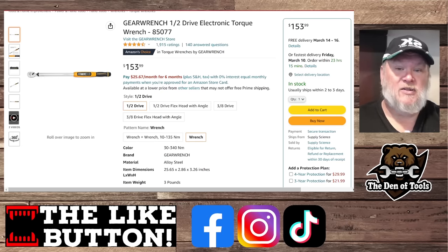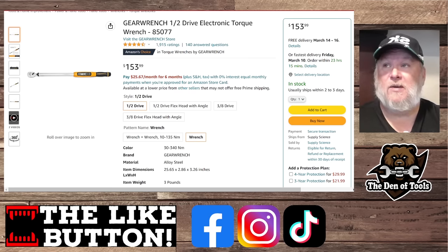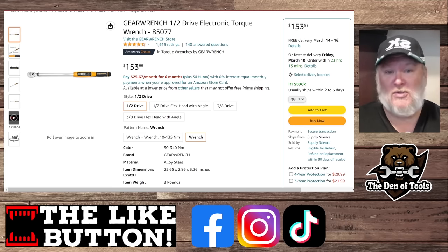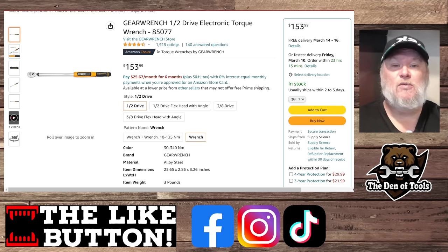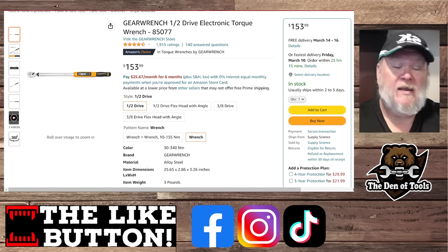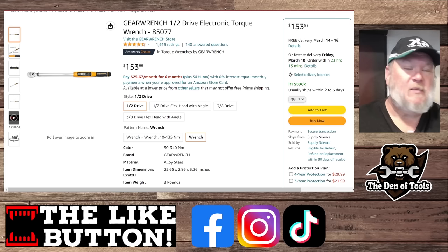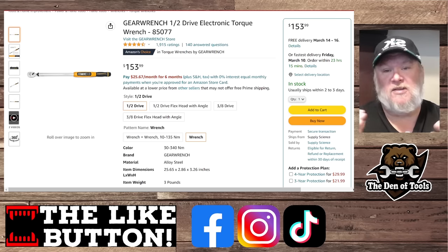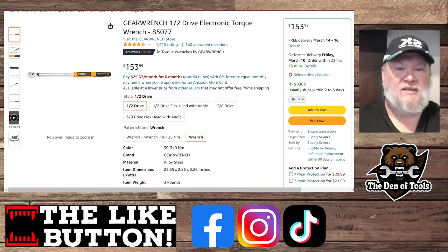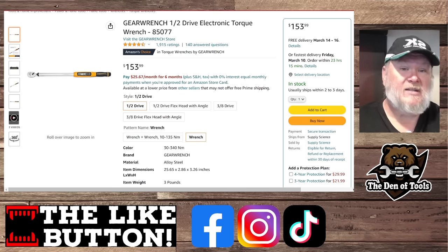Now there are other options out there. Time and tech are catching up. For the same price as that Icon, you can now get the Gear Wrench half inch drive electronic torque wrench. This gives you all sorts of controls and measurements — things you can't do with just a click-style torque wrench. I have that Icon torque wrench, and it's a great torque wrench. I love the cathartic click when you're really leaning into it and you know you got the job done and done right. The electronic ones can do all sorts of stuff the manual ones can't — they can tell you torque range, they can follow the peak, you can dial the setting in precisely and know exactly what you're getting. Honestly, they're more accurate.